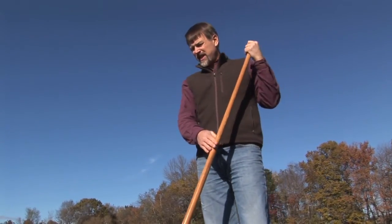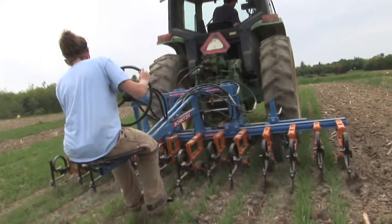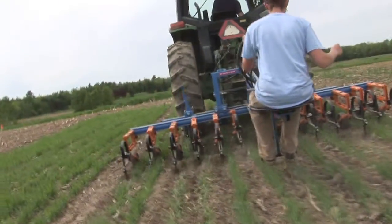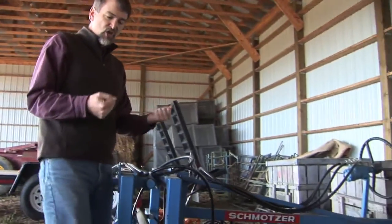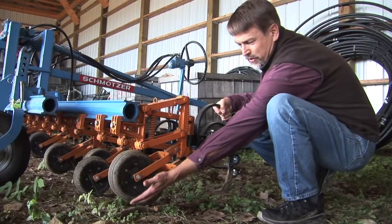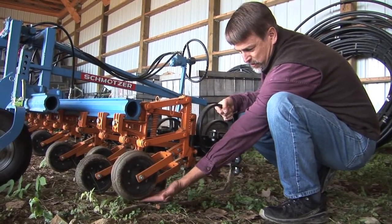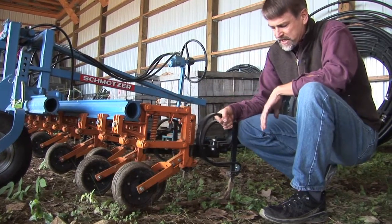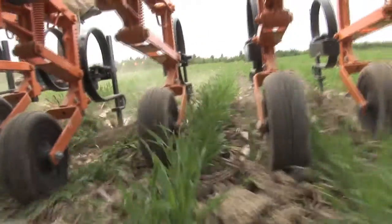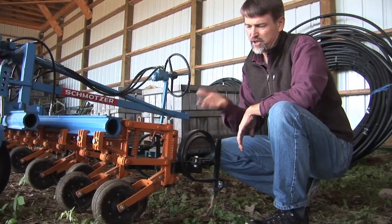There's actually been quite a lot of effort in recent years to innovate in the area of tractor-mounted cultivation equipment. For example, this hoeing implement imported from Germany has a steering wheel, so we can actually put an operator on the back to steer this unit and keep these sweeps as close as possible to the crop row. The wheel rides along the soil surface, and the depth between the wheel and the working point is fixed, allowing it to float over irregularities in the field.